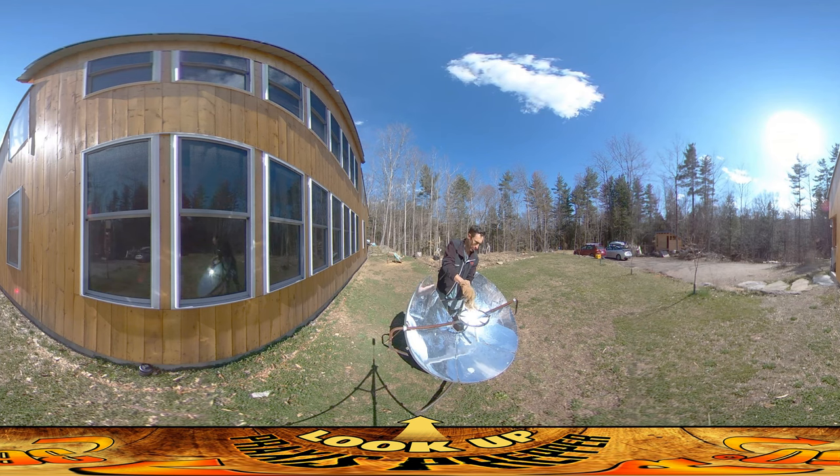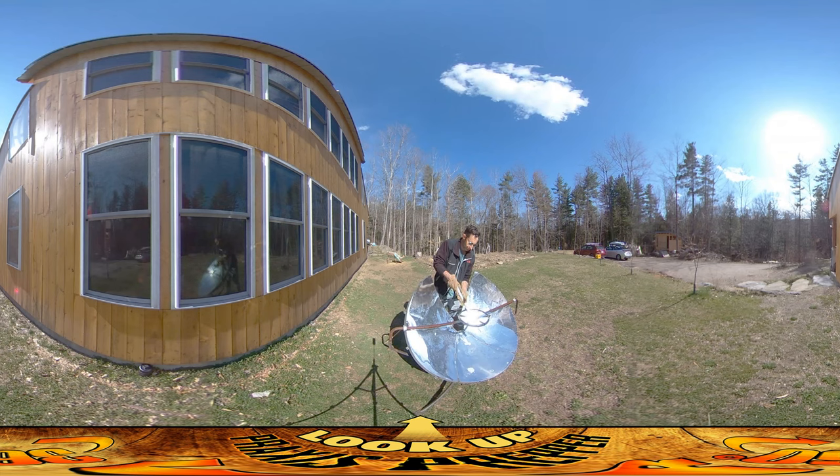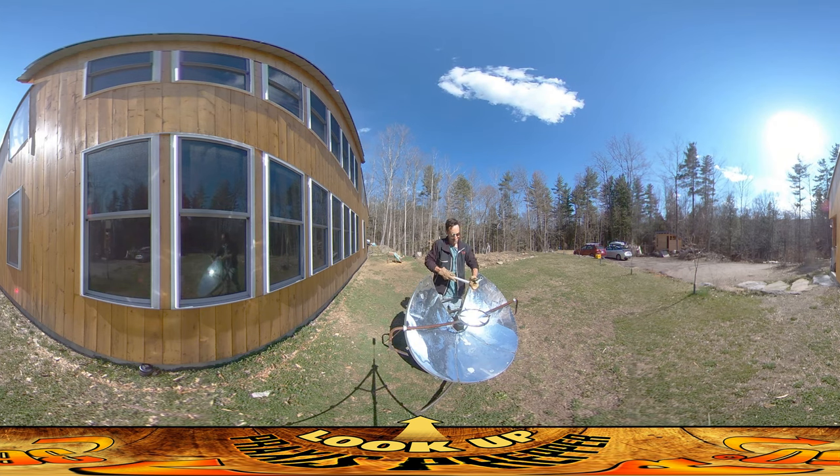I made a little mark on here where I want to do the bends. This is going to be a 90-degree angle there. And obviously I've got gloves on here because it is hot — it's really hot. I'm having a little trouble finding that focal point. The easiest way to do it is to actually put a pot on the bottom, and you can look in this little mirrored reflector to make sure that you've got your focal point correct. Now we're starting to warm up. Three-quarter inch pipe is a little bit thicker than the half-inch stuff, so it takes a little bit more energy to make the bends.